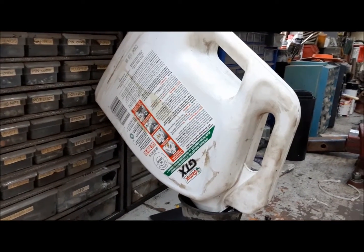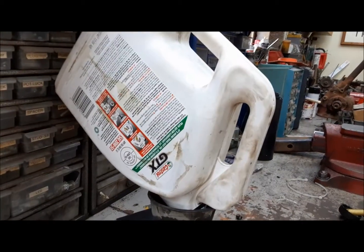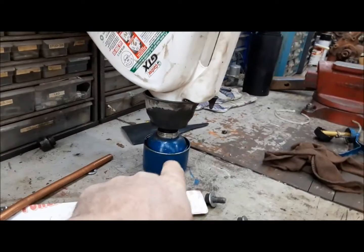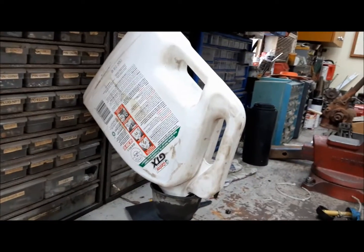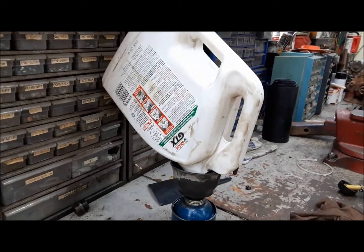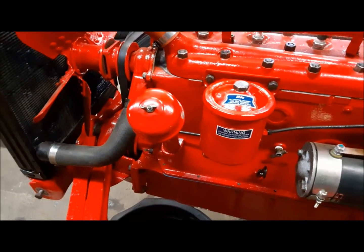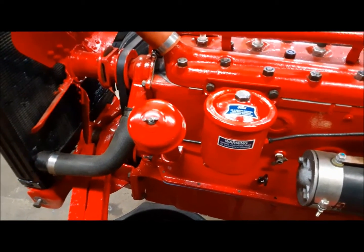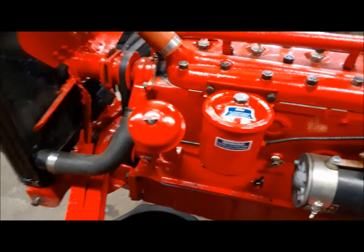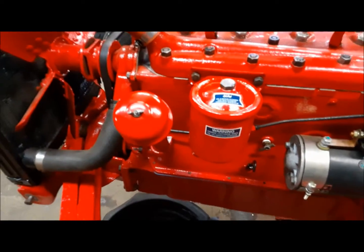And then when we're done putting the oil in the engine, just leave the jug sitting like that for half an hour. I keep my little squirt cans filled up for free around here with the dregs from all these oil jugs that usually just goes in the garbage. That 5-liter jug of 20W50 was a liter short. I guess this thing takes 6. So lucky I had a miscellaneous liter of 20W50 kicking around, so we topped it up with that.